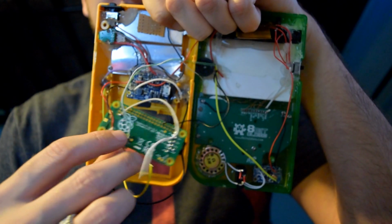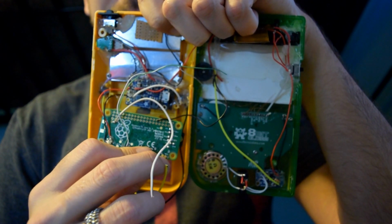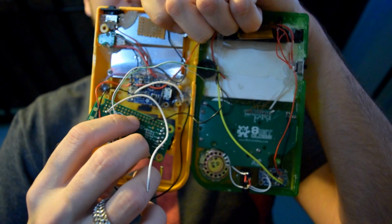And basically what I have to do is, whenever I connect those pins, I have to go in and alter some of the command lines and add a few things to it. So I'm going to add the commands to tell the Raspberry Pi to read the controller board through the GPIO pins. Now whenever I do that, I also have to change my sound board and where that's going to be coming out of. So I have to move a couple of wires around, and then I'm going to have to add, I'm going to guess about 10 connections or something like that. So I have to mount all that and solder it to the GPIO pins. It makes me want to cry.